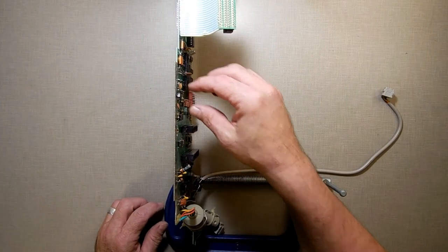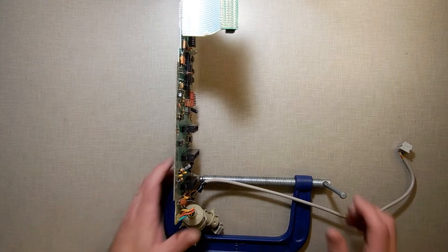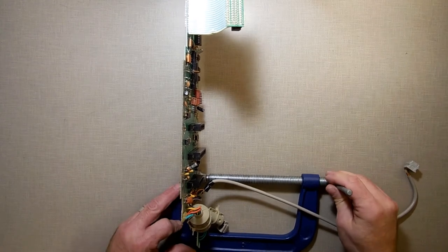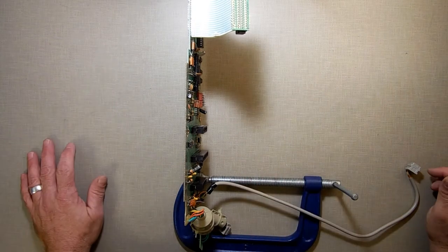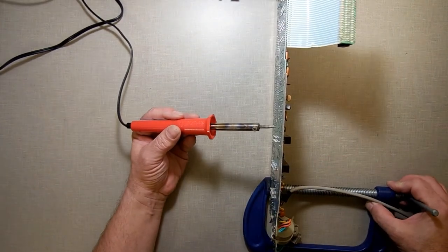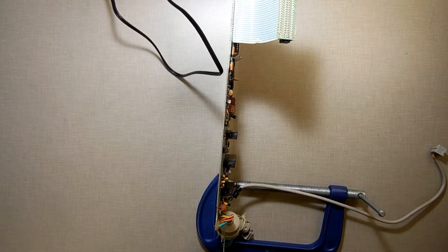What I need to do is remove the pins — to do that I heat up the back and pull the pin out. I've come up with this quick and dirty way of holding the board with a big six-inch clamp and a two-inch clamp. Adjust it so it doesn't have any rock. So now I'm going to remove the pins. I want to film putting it back together and making it work. I'm going to take the soldering iron, apply it to the pin, take tweezers on the other side and pull the pin out — and do every one of them: 128 times. Yeah, you don't want to watch all that, but it's going to get done.